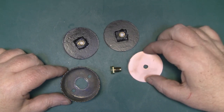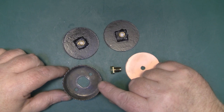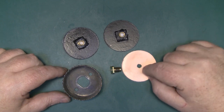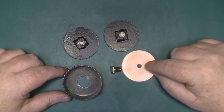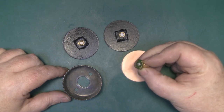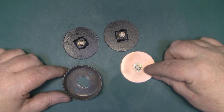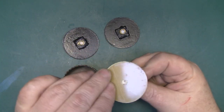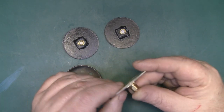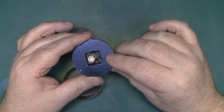That's the coils prepared. I've cut away the waste at the top and straightened this leg out so I can bend it in on itself to solder our main driven element to it. Because this is galvanized steel wire I'm just going to clean it up with some emery paper so we can actually solder onto it. Now I'm moving on to the reflector — I've got some single-sided PCB board and a 50 millimeter hole saw to cut out round reflectors.